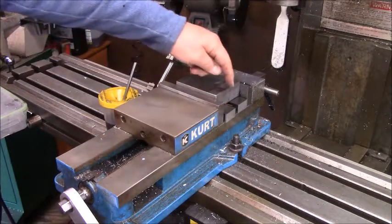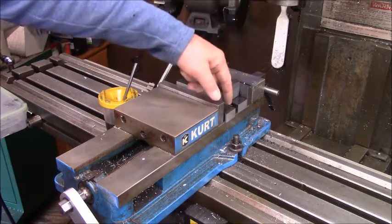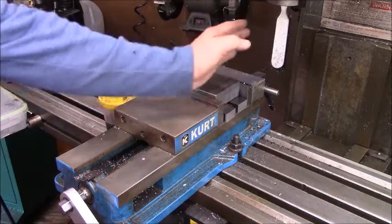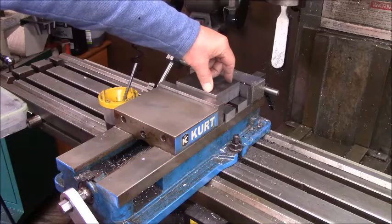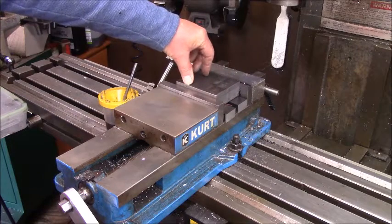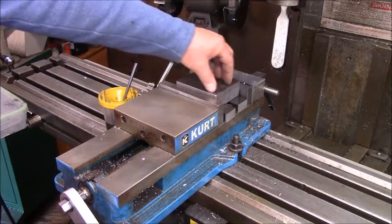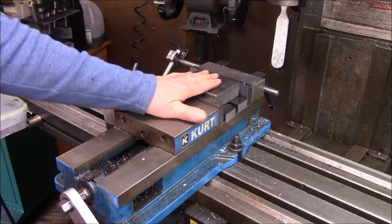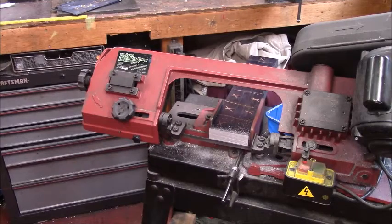So as long as I have this true here, and the dovetail down the center, we can go back and section it later. And once we do that, he's got a reference surface here to work everything else off of. Ideally you'd like to do the edges, but we're just trying to get basically the dovetails in it. So he'll have a reference surface here to work from. He brought the steel, and I'll turn the saw around here in a second. See, we sawed one off, we'll start sawing the rest.